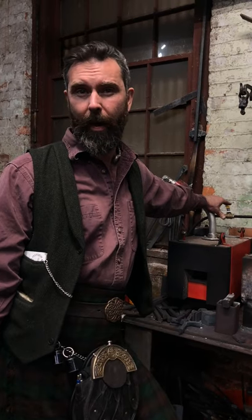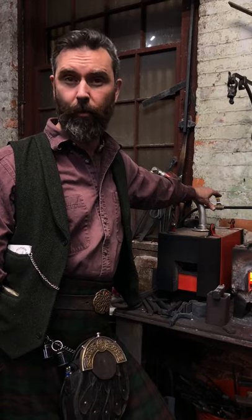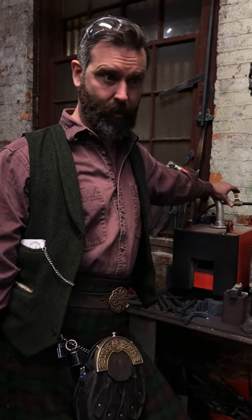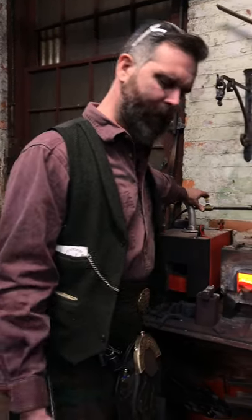We're getting hardnesses that, sure, we could get mid-60s with a 10 series, like 1095. Could get mid-60s if you really, really pushed it. You could make a razor blade out of it. But now we're talking 70s Rockwell, which is nuts. Anyway, that's a little side rant.